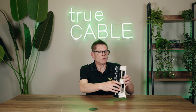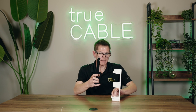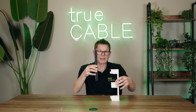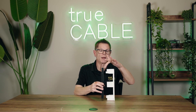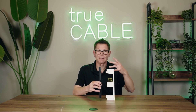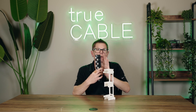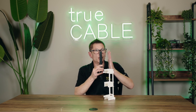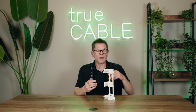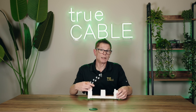Another thing is that we designed this particular panel to be offset — it's got an offset mount. The bracket is a little bit taller than you typically see, and the way the panel frame sits on the bracket ensures that your keystones have a lot of depth before you get to the wall. There's a lot of breathing room for cable bend radius. Without sufficient depth, all your cabling coming down could put so much pressure at the turn at the keystones that it could push the panel frame right off the bracket. I've had that happen a few times — that happens with short-depth brackets and patch panels.